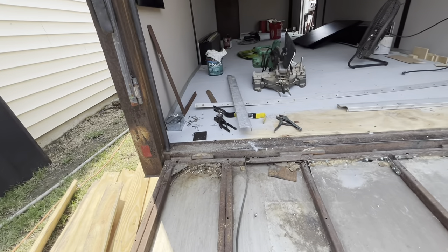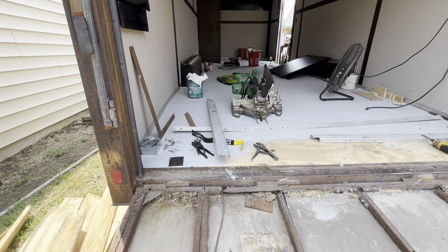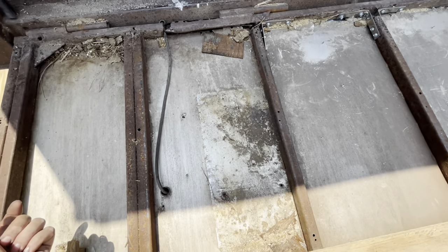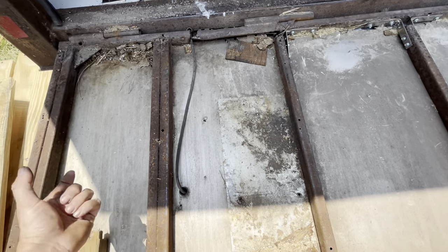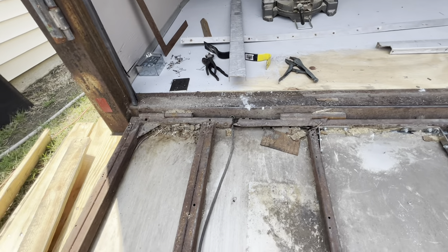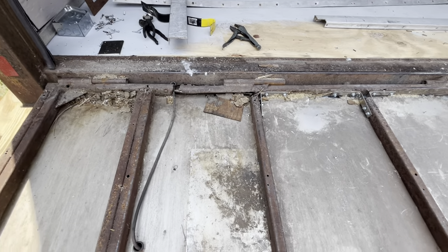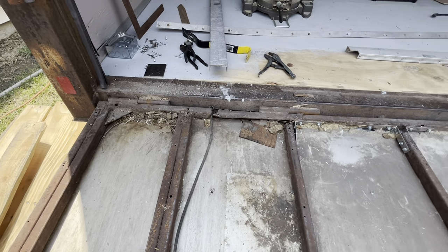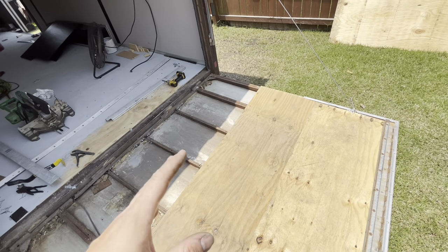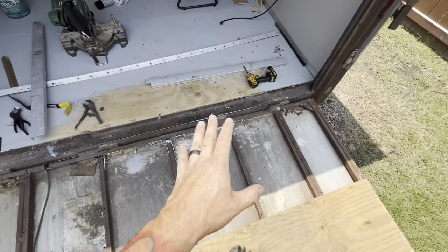So, what we need to do now — it's not god-awful, but we've got our work cut out. We need to get the measurement of these tubes right here. We need to know the thickness of your door. We don't care about the width, we can go wider, but we've got to maintain the same thickness. Because the trim is probably set up for three-quarter plywood, and it's kind of bent in using this half-inch junk somebody put on here. More than likely on your trailers, your damage is going to be down here at the bottom because of the water.